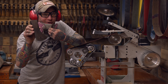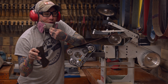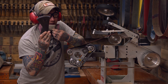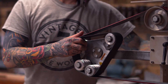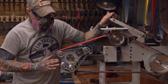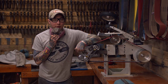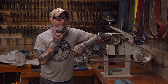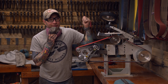That's how easy it is to grind in a convex edge on an axe head. Now I'm going to put a 320 belt on here and turn this thing into a razor blade. One other thing about the 320 belt: if you run it at full speed you're going to burn that cutting edge up super fast — you need to run it at 50% or less on your variable speed drive.